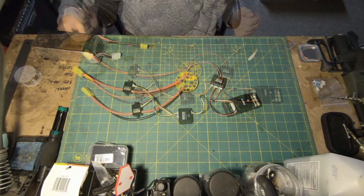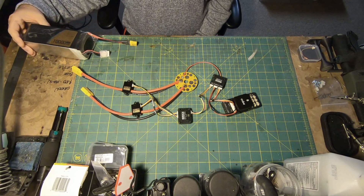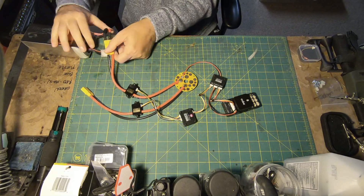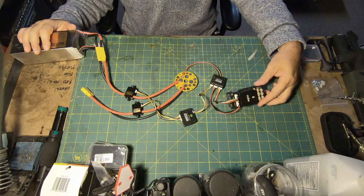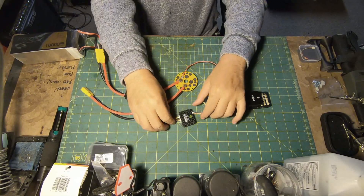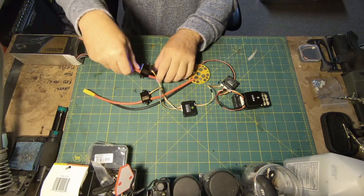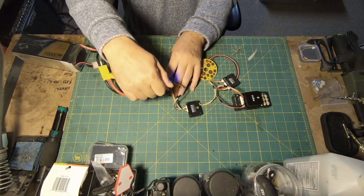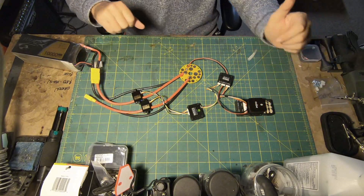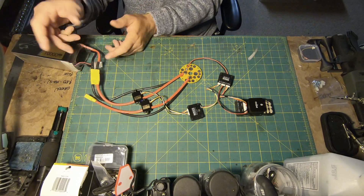That's how it looks — an exploded view of how everything goes together. Sensors feed into the sensor hub at the top, with your two sensors out the bottom, and the lead going into the sensor input, then power one and power two off to your Pixhawk. We've got a 10,000 milliamp battery here — success. We're going to give it a test now. Make sure you plug it in correctly. Usually there's a buzzer here, but you can see we have power to the Pixhawk. The sensor hub is sensing — or that's the BEC. You can see the sensor hub is working, and these sensors themselves have little blue lights. So you know you've got everything wired up right. It's better to test outside before you put it all together.